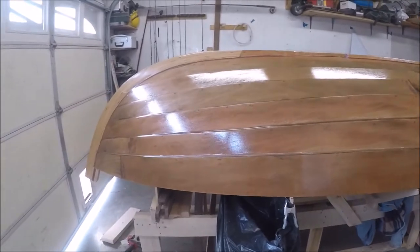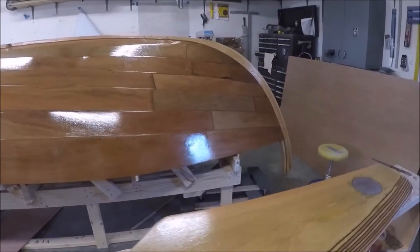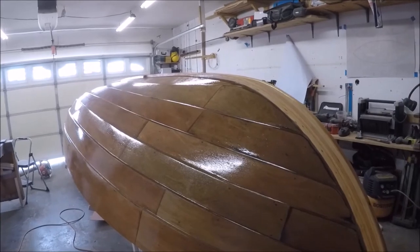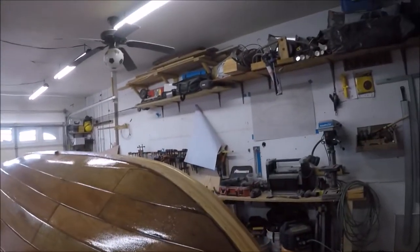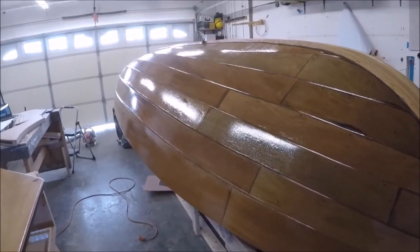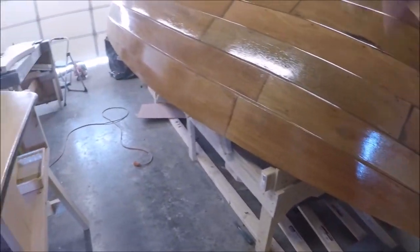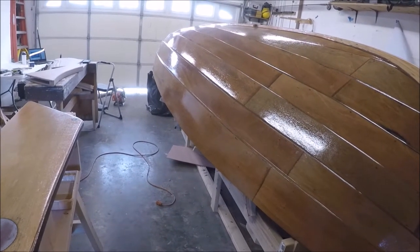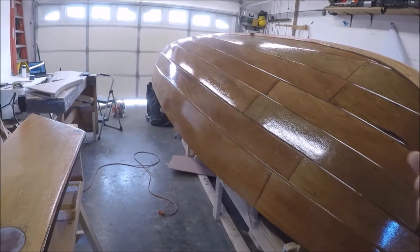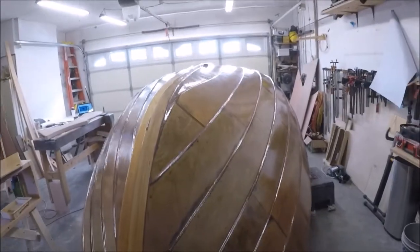Just finished giving the boat a second coat of epoxy. I spent most of the morning sanding down the first coat of epoxy, then wiping it down, getting all the dust off, and blowing all the dirt I could out of the garage from the ceiling and behind everything — tried to get it as dust free as I could. The second coat is on now. Saturday I'm planning on having some people over; we're going to turn the boat over and set it on these rollers down here so I can move it around the shop and start working on the inside. Then I'll get the inside fitted out, and at a later date we'll flip the boat back over, paint the outside, flip it over again, and paint the rails. The second coat of epoxy is done.